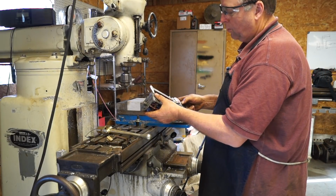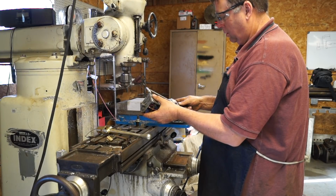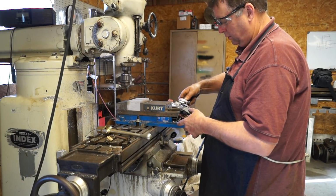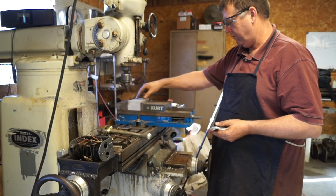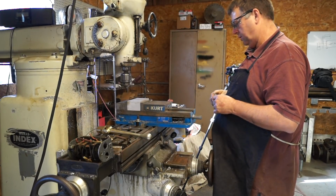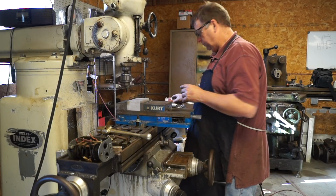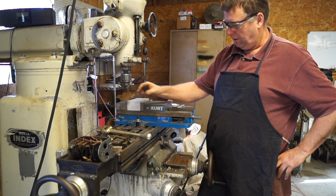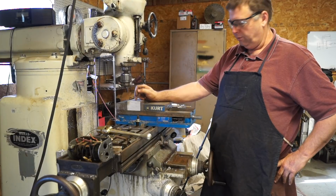In this direction, we're 4 3/4. And in this direction, we're 2 inches. Okay, so we need a 2 inch hole pattern here and 4 3/4 in this direction. Our material, I think, is 3 inches. You have 3 inches 10 thousandths by 5 inches 665. So again, dimensions aren't real critical as far as that goes, but with this 3 inch 10 thousandths, and then I got a 2 inch hole location, so we need to move a 1/2 inch inside and drill the hole.